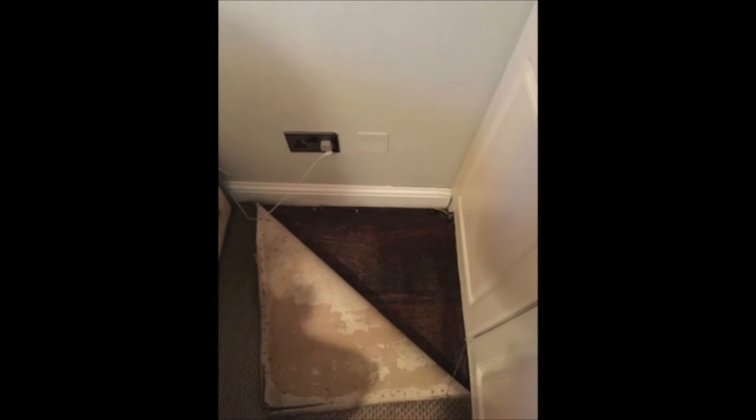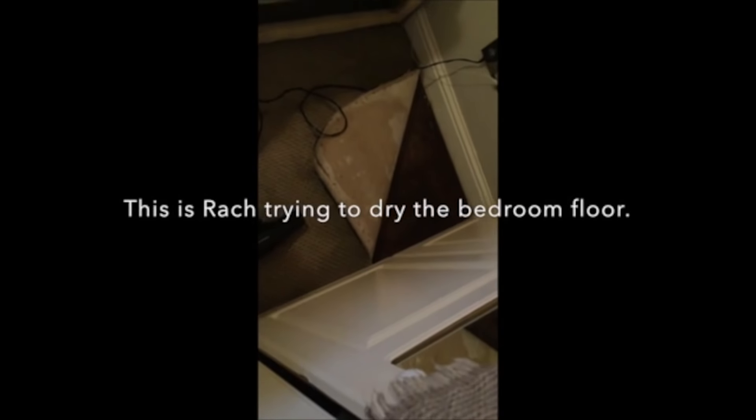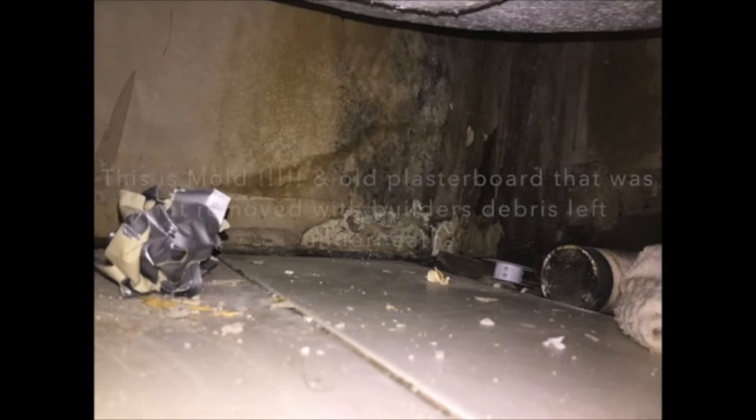This is the classy seal not working at the front underneath the bath. There's no tile there — that's just plasterboard. This is where the leak came into the bedroom, through the hole in the plasterboard. Now in the bedroom you can see the leak has come right in and it's got the whole floor pretty wet. The old plasterboard wasn't taken out and it wasn't re-slabbed as was in the quote — we were supposed to have it re-slabbed and skimmed so that the mold and those holes would not be there anymore.